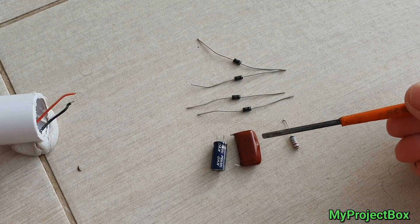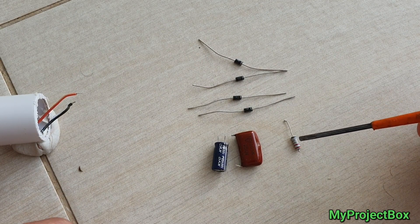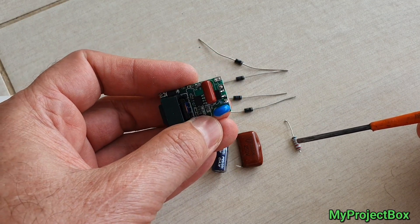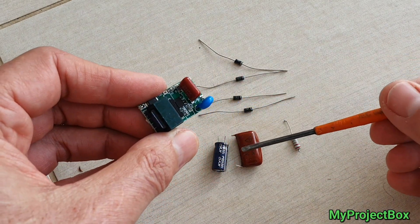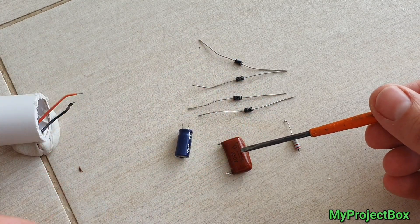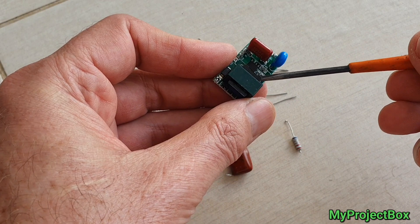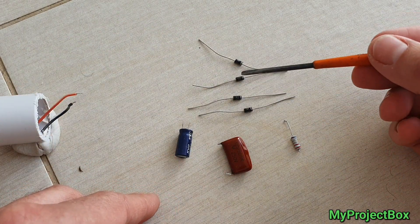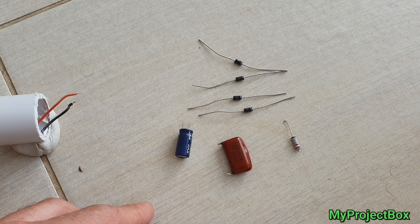So my little DIY driver circuit is going to be very simple: we're going to have the fusible resistor as a protective fuse and inrush limiter — it came off this board originally — and a capacitive dropper, which will be a 1uF capacitor to limit the current and drop the voltage. Then I'll use the original smoothing capacitor from the original driver and incorporate that as well. And I'll make my own bridge rectifier out of discrete diodes — it's just what I have at hand at the moment.